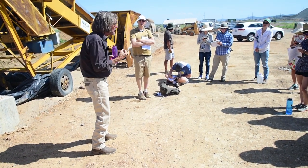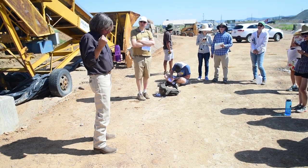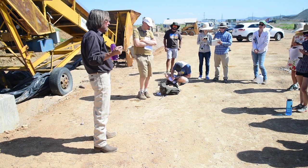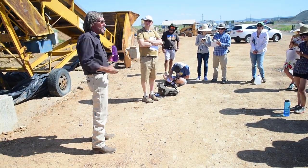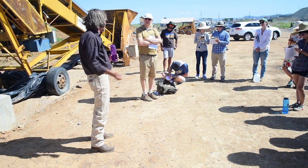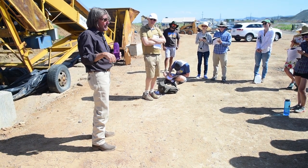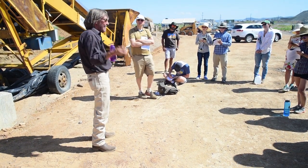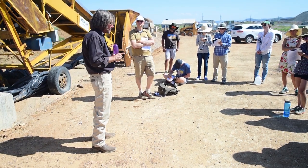This is particularly important if you're stabilizing with lime. The ASTM cure for cement is 28 days, okay? But a cement stabilized block is a rock in a week to 10 days. You can build with it that quickly. If you're stabilizing with lime, the cure is also 28 days and you need it. You need that 28 days. And the reason for that is